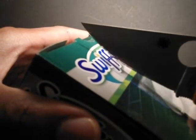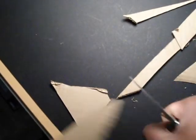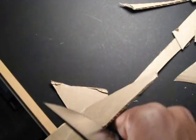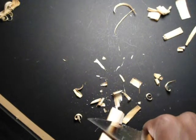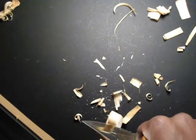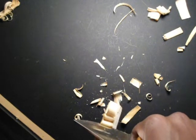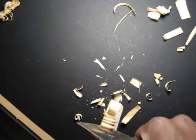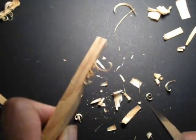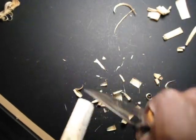But yeah, then afterwards I proceeded to go through fairly dense cardboard and carving some wood. Yes, because we have to carve some wood with the steel. But yes, proceeded to do so, and then afterwards check the edge. The edge has got bite, not as good a bite as I got with the previous sharpening, and if you want the description of that previous sharpening, go back to the Rex 45 versus M4 steel clash on my channel and read the description in that video. You'll see all the things that I use to sharpen both those knives. It doesn't have as much bite as the previous sharpening, but it's not too far off.